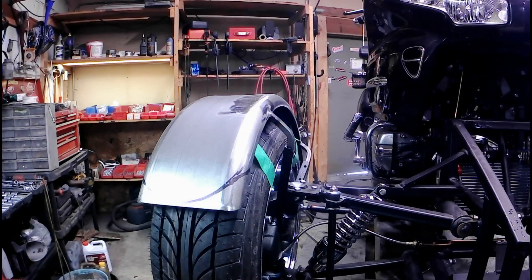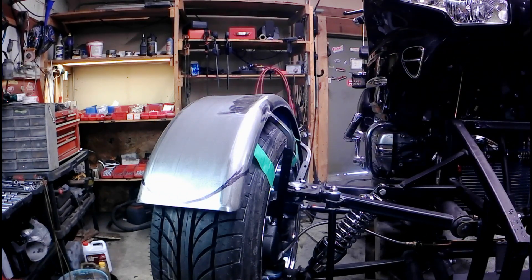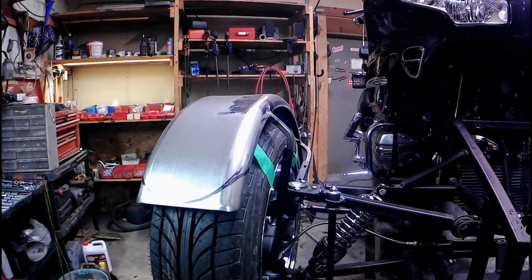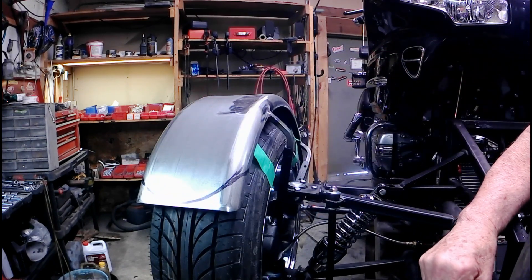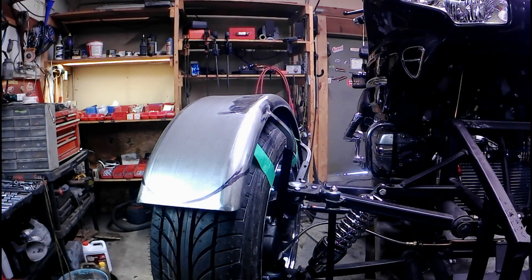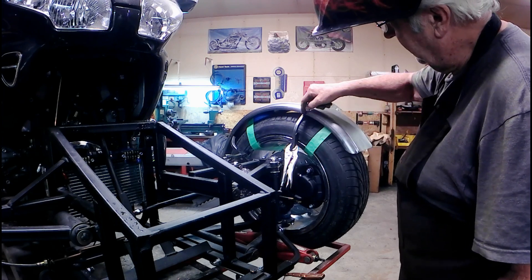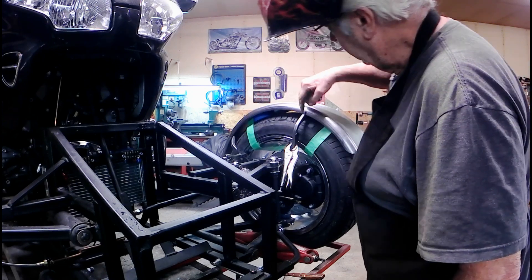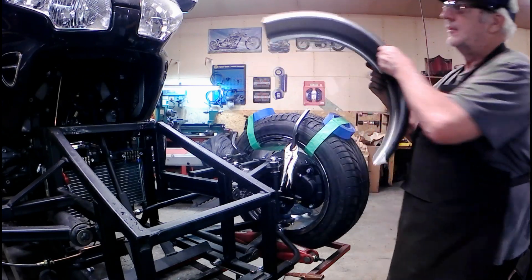You can see this one is pretty well welded together — got the arms on there, got my little curve here, which I use a specialized template to draw. I just have to cut this, clean it up, drill the holes, and it can go in the powder coat oven. So that one is pretty much done — didn't take long. I'll go over here to the one I'm working on now. The first thing I do is I measure back nine inches, draw a line, get it lined up with the mounts, and put a little line there because I'm going to cut a notch in here for these to fit into.